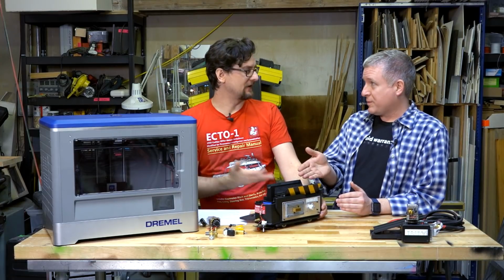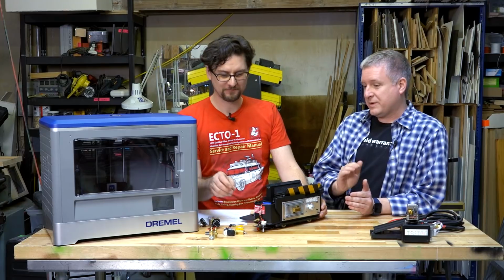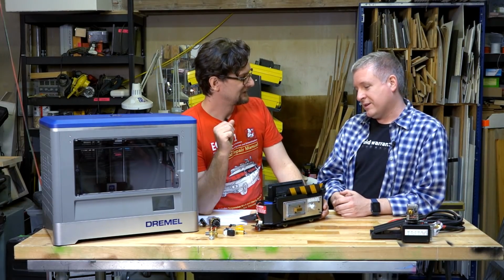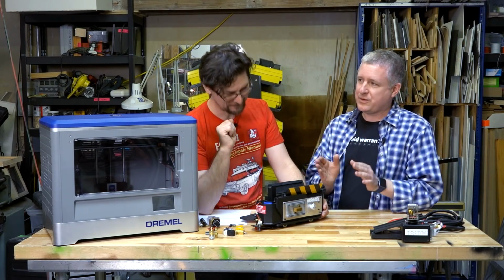I was thinking initially maybe we should just stick with a 3 volt platform. Right, because we maybe were going with a different controller. Right, because we were going with this 3.7 volt battery, and we would stick at that sort of native voltage. But you had some other 5 volt components in here, and it just seemed like there'd be fewer adapting steps if we just went 5 volts.